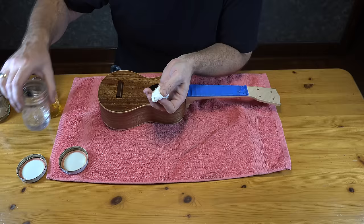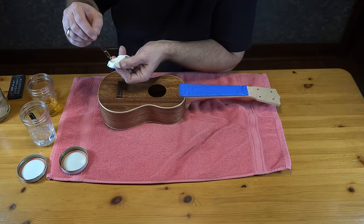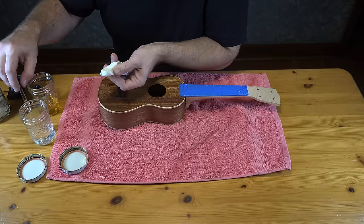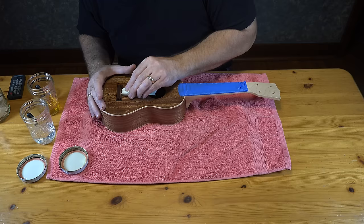And as I said, you want about 10 drops of the shellac, but that's on a pad. This one here, you'll probably only need a couple. There's four. We'll start with that and see how we do. And let's do another four of the alcohol. Three, four drops of alcohol and a little bit of oil just on the end of your finger like that. And we're gonna start bodying tight in here to the bridge.